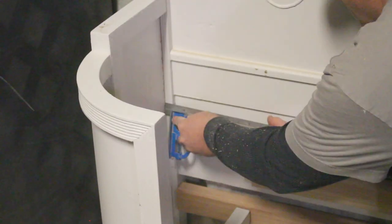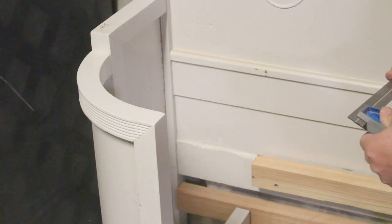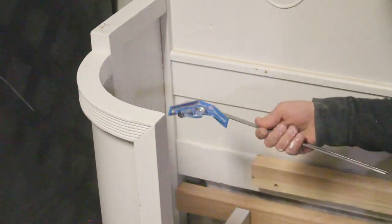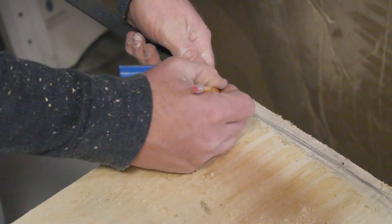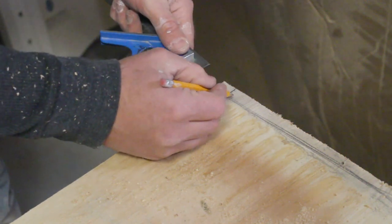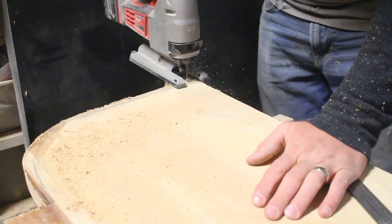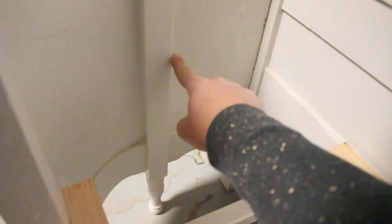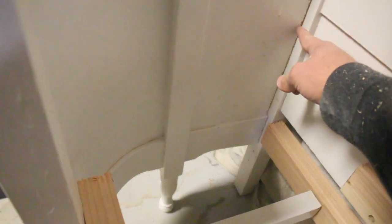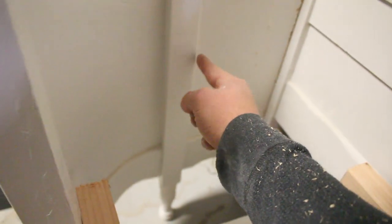Now that I've got the basic shape cut out, I'm going to use the combination square to go in here and figure out the depth of this inset right there. It looks like it's right about five eighths — same on that one. I'm just going to go in here and notch that square out on each side, and do it over on that other side as well. That'll be just about right for my insert there. So this is seven and a quarter inches here from the back of this to the front of this. I'm just going to measure from the back and start my first little notch — I already know that that's five eighths inches deep. So I'll notch that out right there.